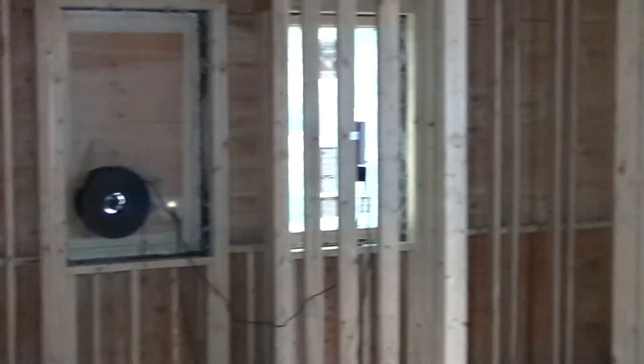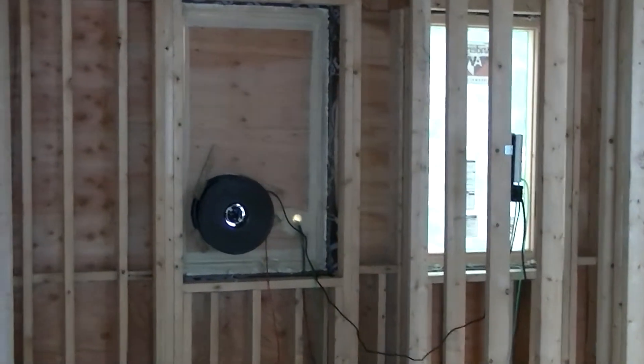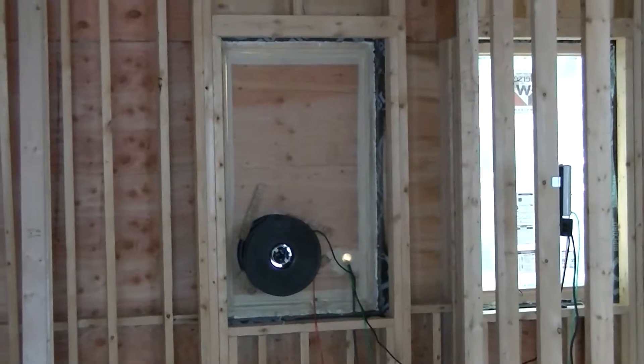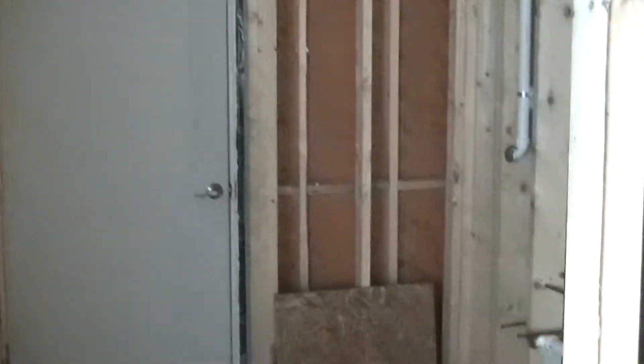We're inside my house right now, and I wanted to show you guys what's going on. Currently working on this place. I haven't sealed the door yet — just got them installed. But I'm setting up a blower door duct blaster. It's the fan from a duct blaster; I made the plywood cutout for the window and I'm using it like a blower door.